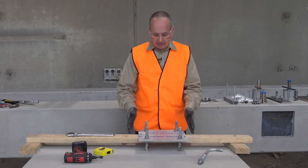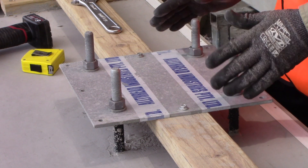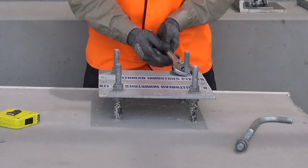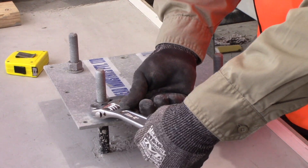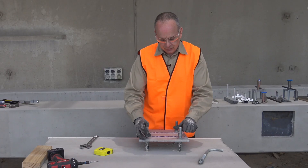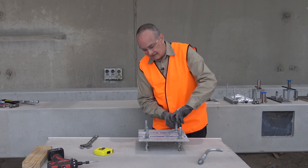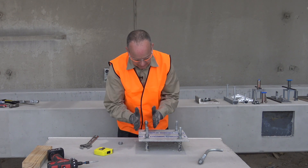What we'll do now is strip the temporary support form away from our L-bolt configuration and prepare it for the installation of a finished base plate. Now we have our four bolts exposed. We'll run off the four top nuts so we can get access to the underside. You will see that we've taped the bolts up to prevent concrete slurry from getting into the threads, which gives us easier access. If you have a long-series socket of the right size — in this case 16mm bolts, 24 cross-flats socket long series — it'd be a far quicker way to run the nuts up the threads and off the L-bolts.